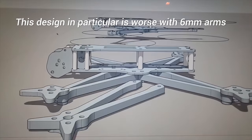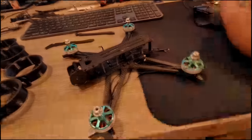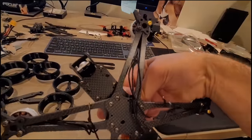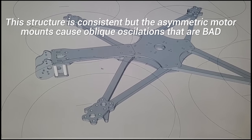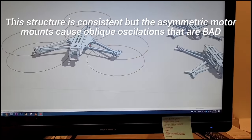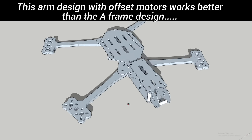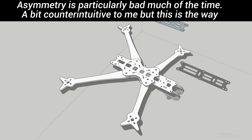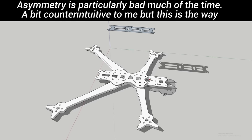There is no easy way to figure this out. A lot of people have tried to come at this with finite element analysis, simulations, math, and whatnot. That is helpful here and there, but designs that have struts or structural elements to the arms that help with one particular mode — the twisting mode of vibrations — they can only do so much. This is a battle of adding stuff to the frame design to manage various types of vibrations versus just lowering the entire noise floor across the board. It does not matter what frequency you actually end up dampening — any noise floor reduction is helpful.